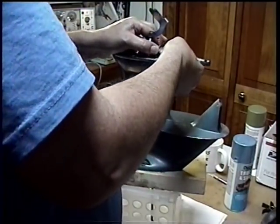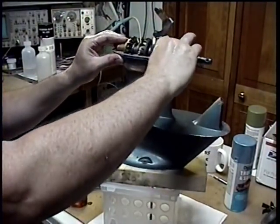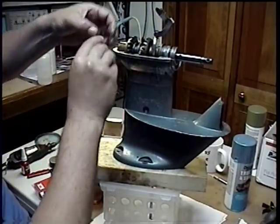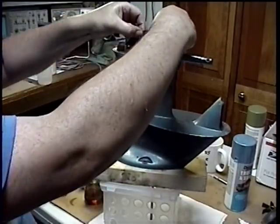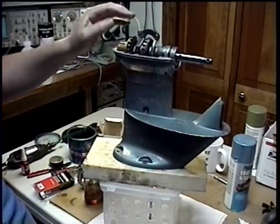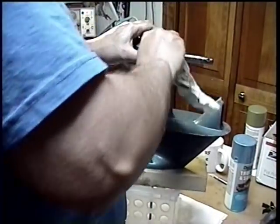The front piece has to sit on the pin, so this goes on here like that and goes down. This drives the clutch dog, so let's put oil on this — it goes right over the clutch dog, and then this pivot point fits right inside it. See how that works? If I hold the pivot, see how the clutch dog moves in and out? That's how it shifts. That's neutral right there. That's pretty much the whole gear case — now we've got to reseal it and put it together, so we've got to clean this up and get it ready for sealing.